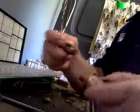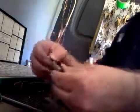So then, you stick the old key in the lock, you turn it. You don't want to pull it out. All kinds of stuff explodes. Take this little follower tool, push it through, and it comes apart just like that. It holds the springs in the top because all you're changing is these bottom pins.